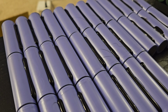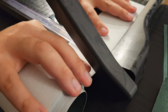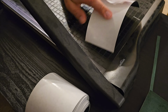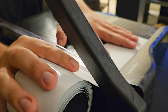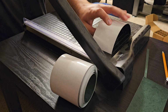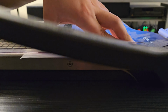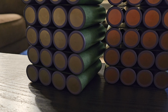We did run into some issues with the height of this deck though later, which I will explain when we get there. Next up was the battery build, and for this particular board we had a cheaper battery made of the Lishen 2170 LA cells, and these are a 4000 milliamp hour cell that is pretty similar to Samsung 40T, and so we are doing a 12S 4P of those, and of course making sure to cover them all in Fishpaper.